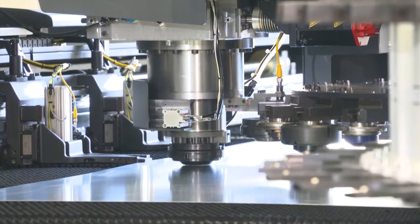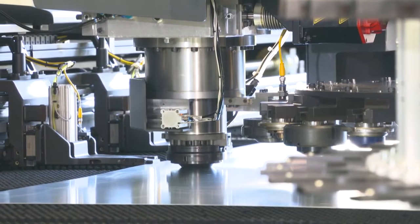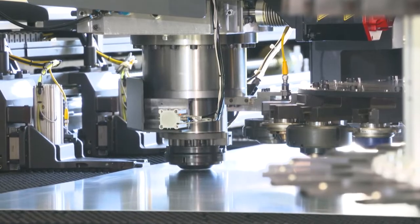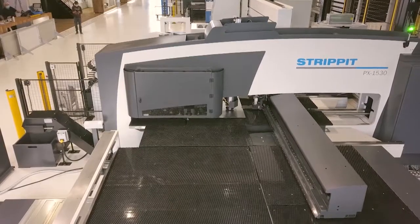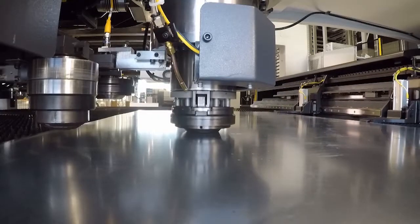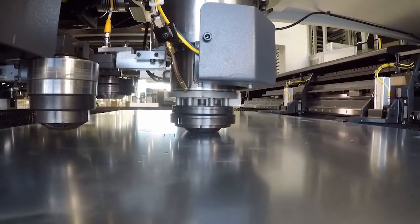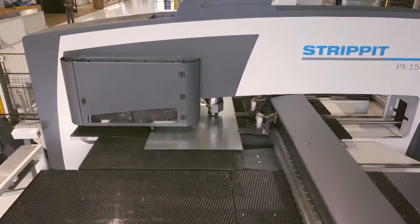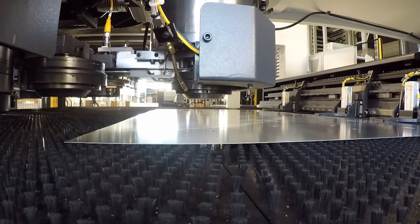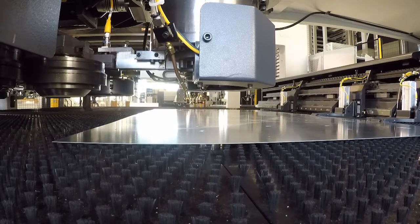Let's start punching with the multi-tool integration — up to 10 punches in one tool. All individual punches rotate 360 degrees and eccentric machining makes the multi-tool suitable for almost all applications. This tool increases productivity by fast tool change time in the holder, with change time of 5 to 7 seconds from last to next process position.